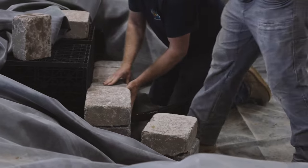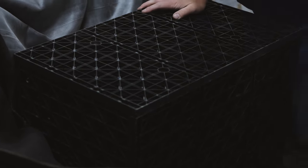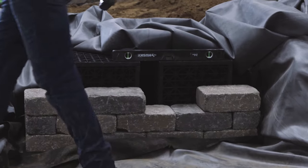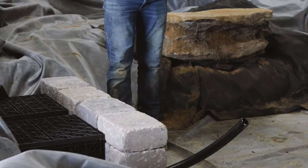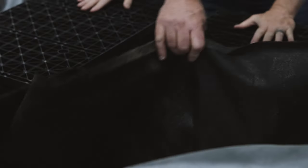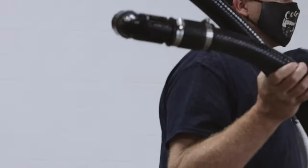So basically what we're doing here is we're creating a false wall for the pond. We over-excavated this and added the eco blocks, so that way our patio can actually come right over the top of this. We're going to set one of the Atlantic copper bowls right here, so part of the copper bowl will flow into the patio and part of the bowl will flow right into the pond. By creating a false wall here, we create a chamber to hide the eco blocks as well as all the gas and plumbing lines for the copper bowl.